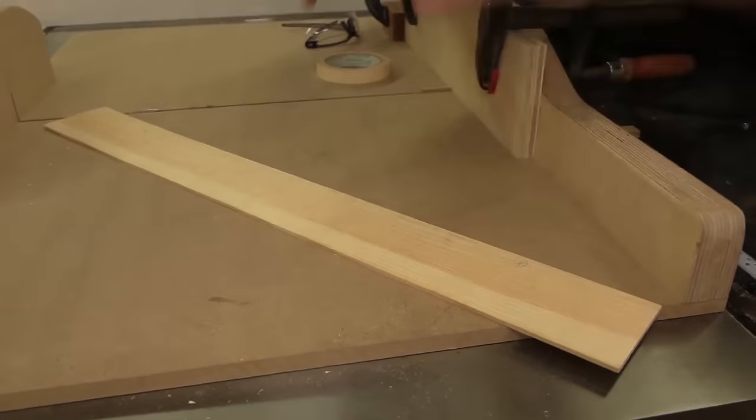This one was glued up about 2 hours ago and it's stabilized and it's nice and square, but I didn't clamp it. And look at how those are seated. You can see, you really just want to make sure all the fingers were seated. All I did was squeeze it like I showed you and they held in there. Once you could tell they weren't going to move, now it's solid and we're good to go. If I was to put this bottom on right away, I won't put it on, but I'll show you. I would just take a block plane and go around.